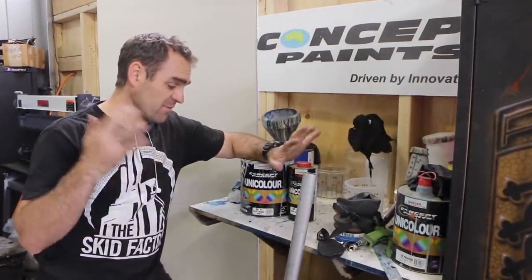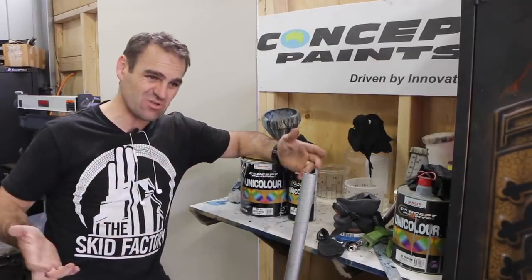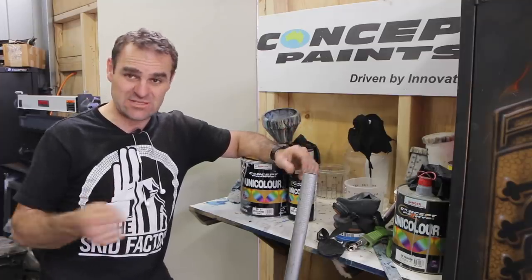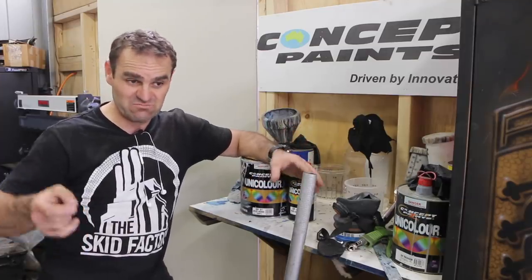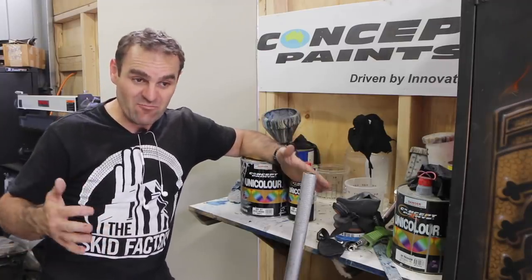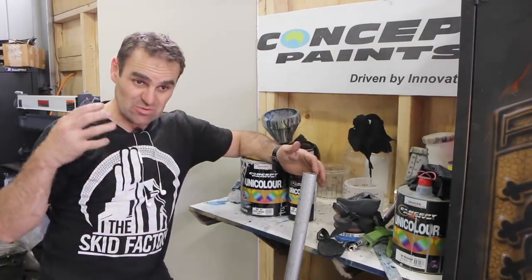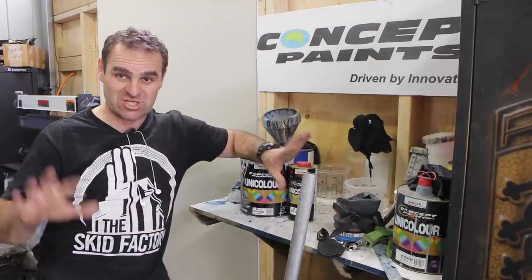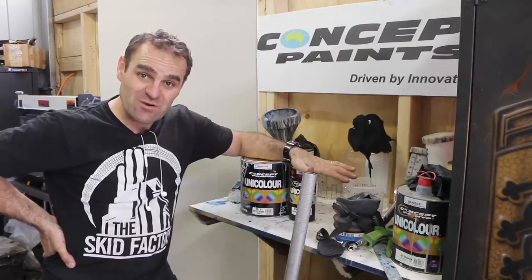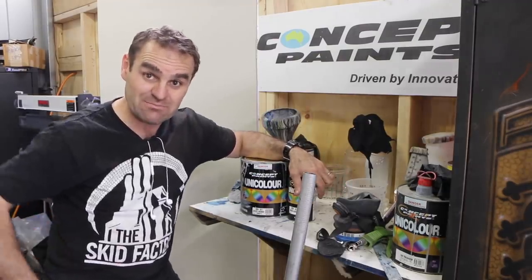And it's time to mix up some paint. I'm going to be using a 2-pack epoxy primer on the inside of all these panels. This is what Tim uses. You can use some of these single stage rust protection paints under there. I mean, ultimately it shouldn't get water and stuff in there and rust away, but they do. So this is just going to bite in, give it a good layer of protection inside all these places so that hopefully it will last a very, very, very long time. So I'm going to mix this up now and start painting it on.